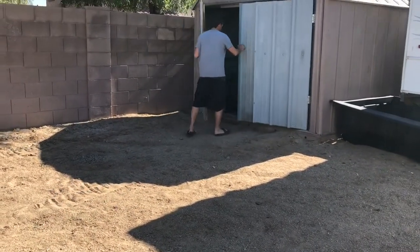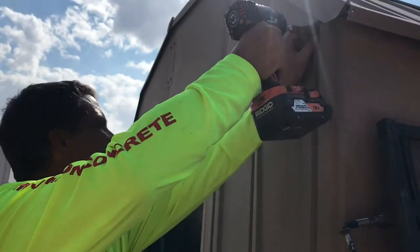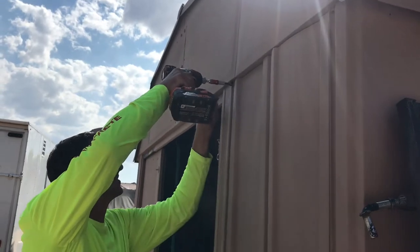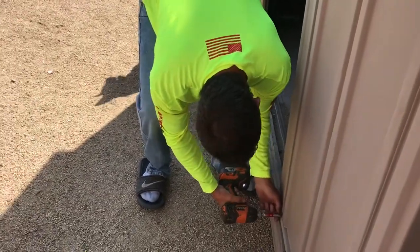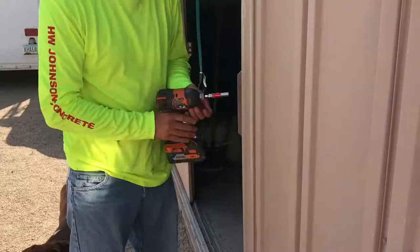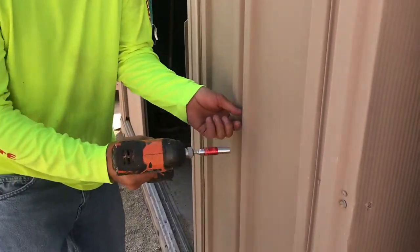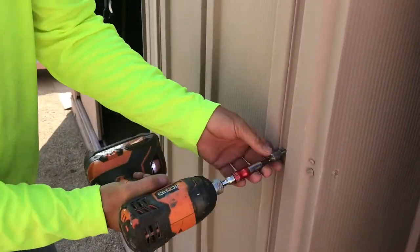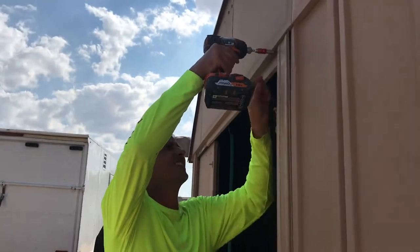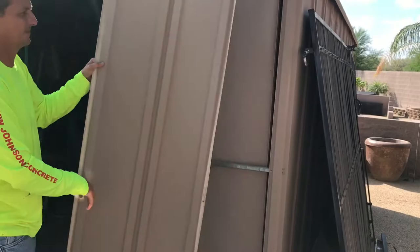The first step to this project was to remove most of the front paneling and doors off of the old shed. Depending on the shed design, you might need to support the upper rail for the door with something while you take the front paneling off. On my shed there was a top bar over the door that went completely from side to side, so it supported it just fine without the paneling. I was careful during disassembly because I was planning on reusing a couple pieces.